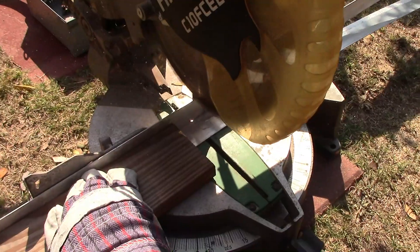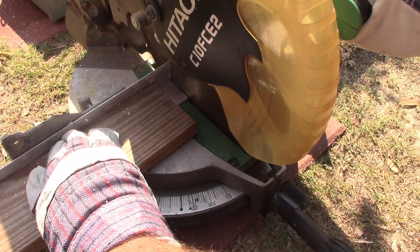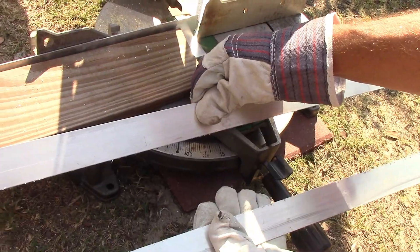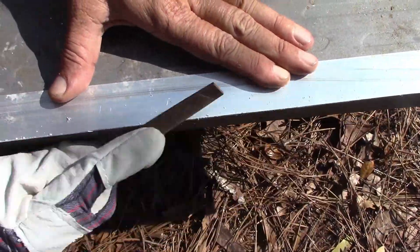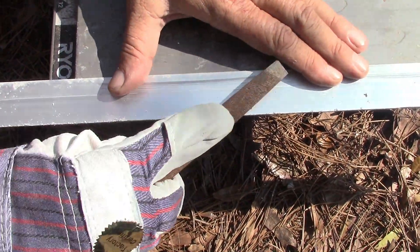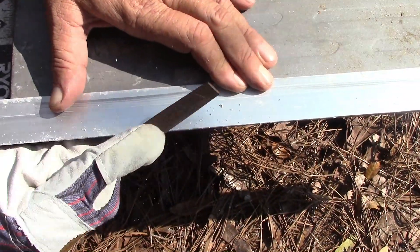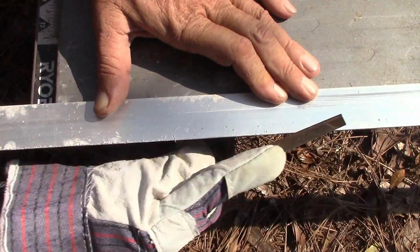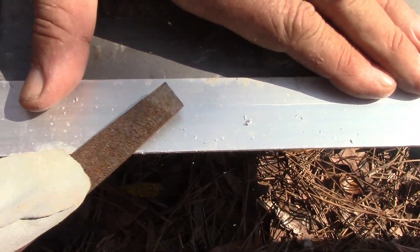You definitely want to think of safety. You see how I stopped the blade before I pulled that out. I put a board over the aluminum — you don't want to use your hand. The aluminum can catch on the blade and kick real quick; it will literally tear your hand apart. I've had that happen to employees at our aluminum company. I'm filing down the edge to clean it up, remove all the rough burrs, and round it off. Always wear goggles and a glove when doing this.